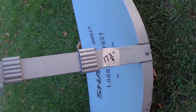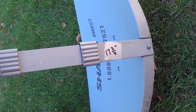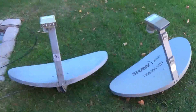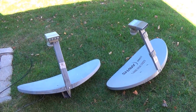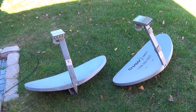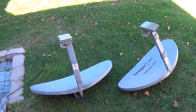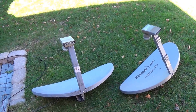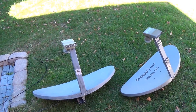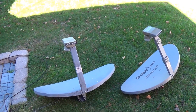If you buy a dish and it's a 60E, make sure the arm length is 17 and 3 quarter inches. Otherwise the focal points are wrong and you will never ever achieve optimum signal. You can get your TV to work — your signal's at 50 and you're watching TV and think everything's great on a sunny day. But as soon as you put clouds into the mix or it starts raining, you're finished. So please be careful.